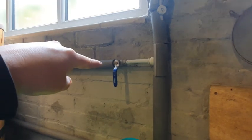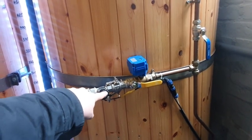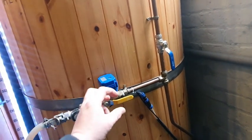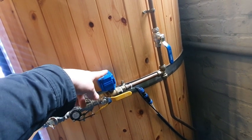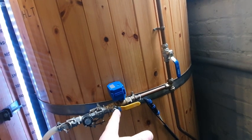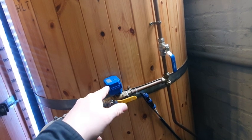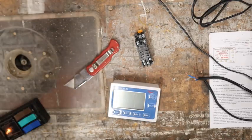I'm going to replace this valve with another water meter. The assembly we need is the hall effect sensor to monitor how much water is going in, we need a valve to manually isolate the supply, and then these units usually come with a solenoid valve - but I don't like them because the flow is far too restricted. So I've changed them out for rotary ball valves, which involves implementing an extra relay into the build. Instead of activating a solenoid valve, it puts power to a relay coil, which switches the polarity of the input cables for the rotary valve to allow it to open and close.